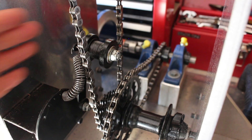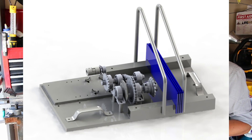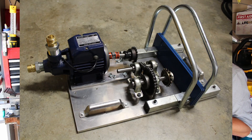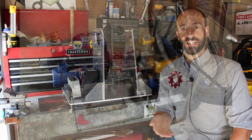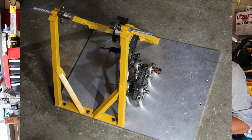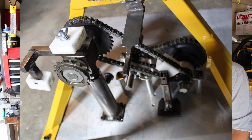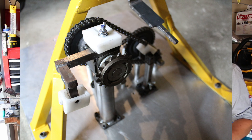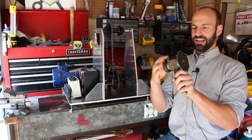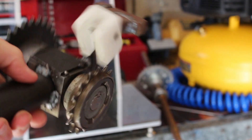I like the idler tensioner and the fact that you can swap out implements. We can also glean some lessons learned from the second and third generation bicycle generators. The second one was actually really good — it just was made of cheap components, but it required a tooling changeover where you'd pull off your bicycle chain and put on a special longer chain to interface between the bicycle and the generator. The third generation tried to eliminate any changeover, just plugging your bicycle directly into the generator without changing any axle or chain, but it just was too complicated. There were a lot of moving pieces and we ended up with things that had to be perfectly in place for it to work, and it didn't work that well — but it was a great idea and the students did a wonderful job.